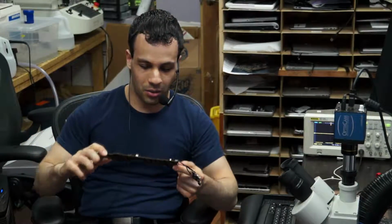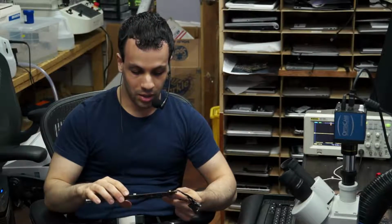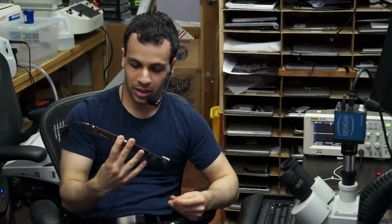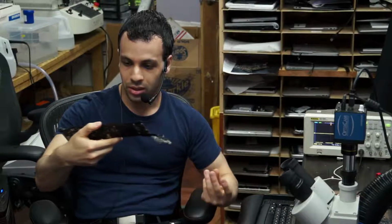So again, there's going to be a lot of people who do silly things, and this is one of the things about BGA rework that really gets me, is that people think that the machine fixes the boards. They think that if you just get the machine, you're set. And like, they would totally replace an MCP. They would totally replace a PCH or a CPU, because they look on the schematic and it says on the schematic that the PCH creates the sleep signal. The PCH is not working. Let's replace the chip. The chip is fine. It's the traces that are bad. And that's one of the things I want to get across, is if you have your brain, you don't have to spend money on tools, because most of the time you don't need them. You just need your brain.